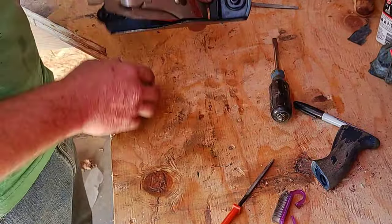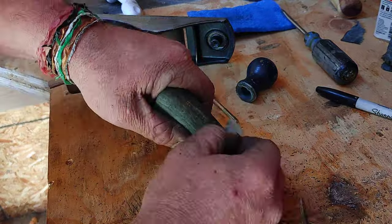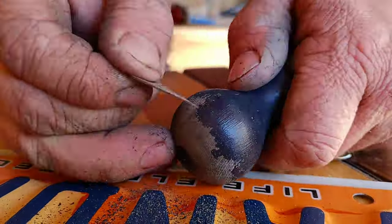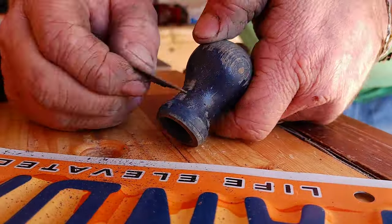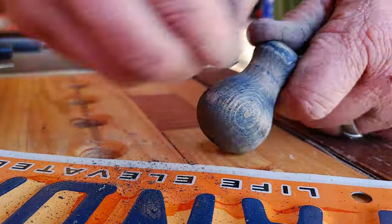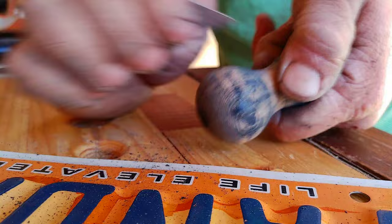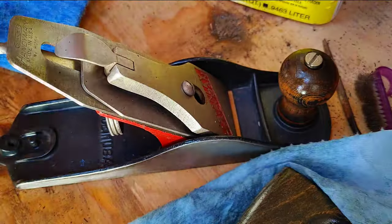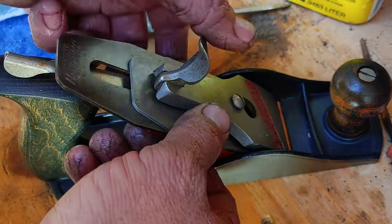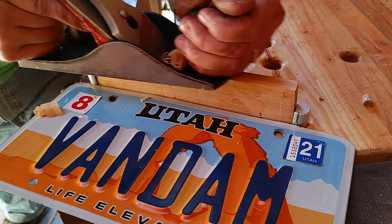Without having any of the nostalgia lost. A really good way to get rid of the paint is to just hold a razor blade at about 90 degrees from what you're scraping and just scrape it off — it came off pretty easy for the most part. Otherwise there was a bunch of grime built up from excessive use. I gave everything a nice thick coat of boiled linseed oil, and then finally got to reassemble everything.